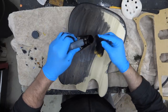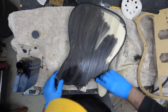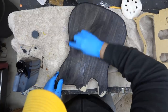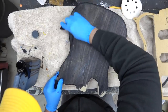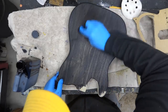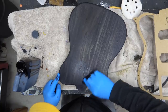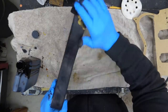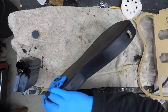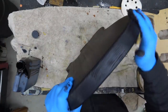What's really nice about poplar is if you let it sit for a while it sort of browns up — all those greens turn to brown. This is a one-piece poplar back. As this ages up a little bit with the dye it'll turn more of a black and a brown. You can see on the end grain here the black absorbs nicely — it's going for exactly what I want.